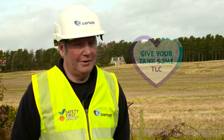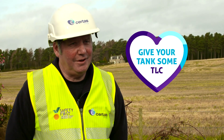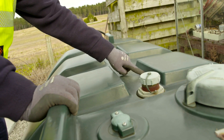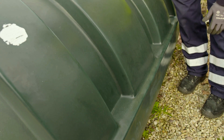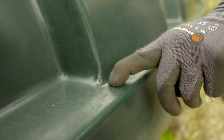The easiest way to check your tank safety is to give it some TLC — Texture, Location and Colour. Texture is to look for any cracks in your tank. These cracks can appear anywhere at all in the tank, but normally at a point where there's a change in direction of the moulding.